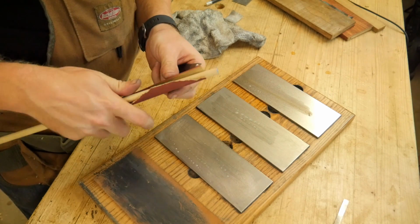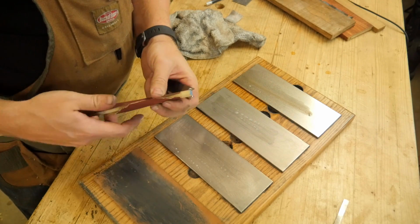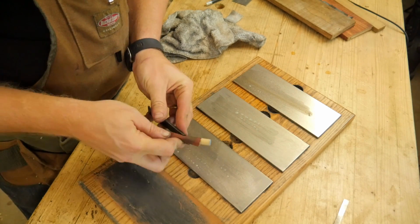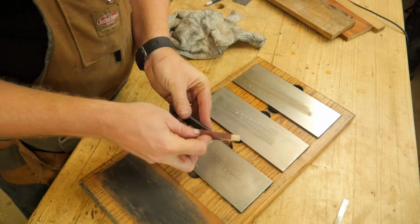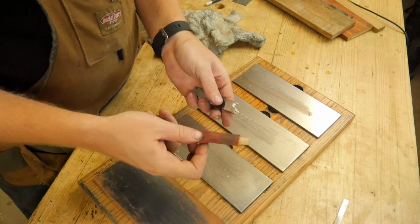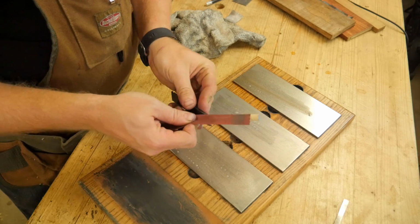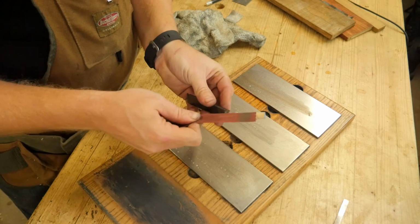Put it this way, and then I can fit those rods into these different curves, and so I can actually sand it down. And so I'm going to do basically the exact same thing, but I'm going to do it with 100 grit, 200 grit, and 400 grit, and I'm going to stop at 400 grit. You really don't need to go much of anything higher than that.